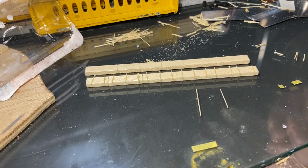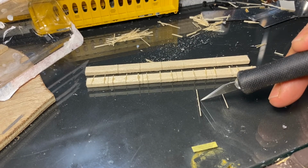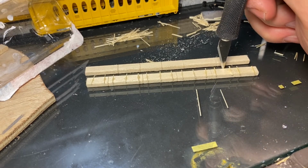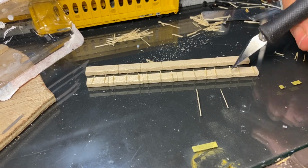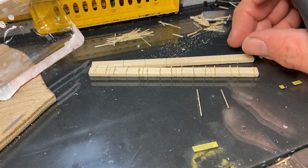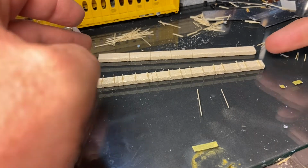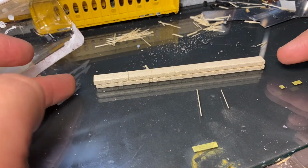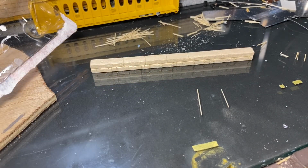Now, if I was building a load for a bulkhead, first thing I'd do is take some long pieces and run them vertical. Just attach them to one side. Come back with a little longer spacers and span both pieces so you put them together. But since we're doing a Centerbeam load, all we're going to do is spread some glue and stack that on top. Now that that's glued, I'm just going to repeat the process until I get whatever your desired stack height is.